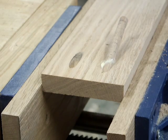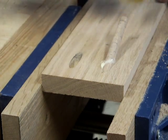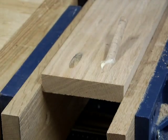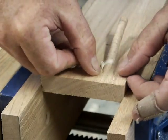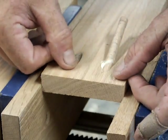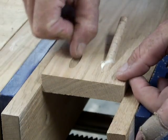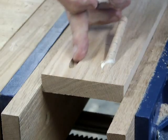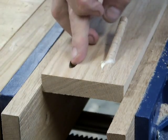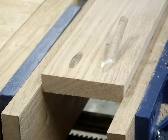If I tap that in — okay, it's in. See, the drill doesn't drill a perfectly consistent hole. Also, the steel burnishes against the side; it's the nature of the beast. It leaves steel residue there off the drill bit — you can see it — and that probably interferes a little bit with the glue surface.